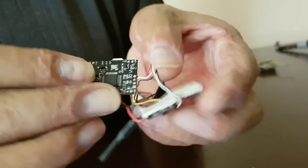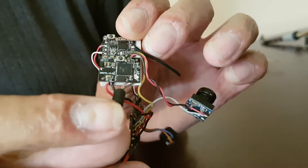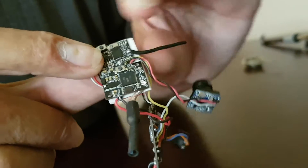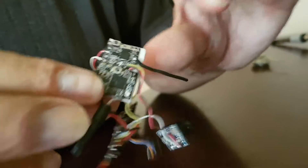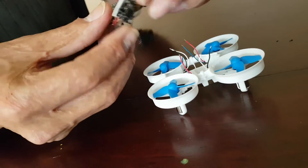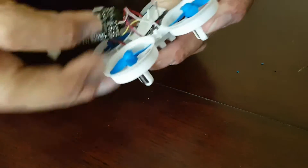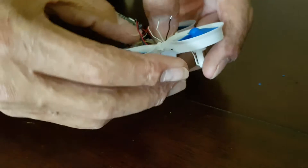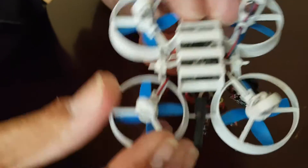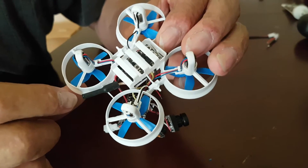With this you're going to want the video transmitter mounted with the antenna at the back, and the receiver mounted with the antenna out of one of the sides. I prefer this side as it makes the bind button still nice and easy to access. This is the front of the helicopter, this being the back where we removed the post. Slide the antenna in through there and press the receiver in to the very bottom. It should sit really nicely along that bottom tray so that you still have access to your bind button and access to the video channel selection.